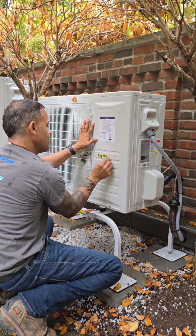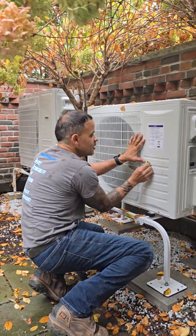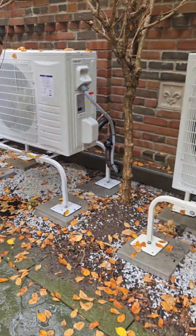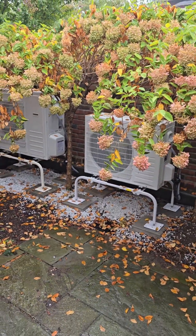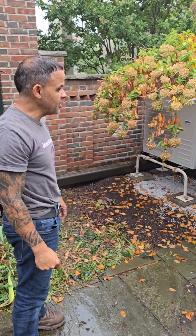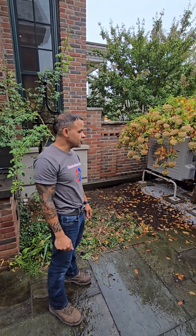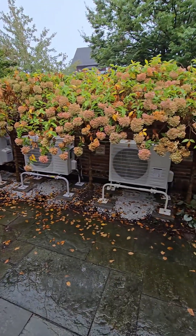What's going on here, Hector? Cleaning up the units, nice and clean. So you guys just finished putting these units in. They're ready — the pressure test. They've been holding about two days, each one of them on 450 PSI. Why are we pressure testing them? Just to make sure there are no leaks in the pipes. We open up the valve and we do that as one of the first things because we've got a lot of work still left here, so we've got plenty of time to test them.